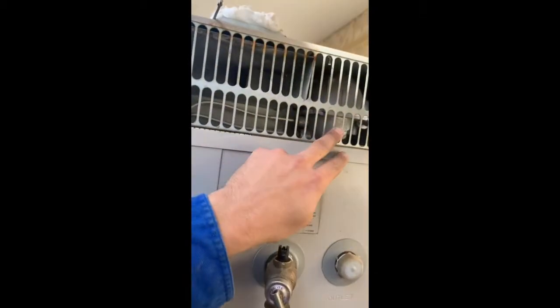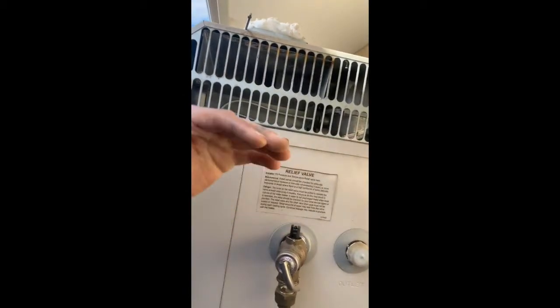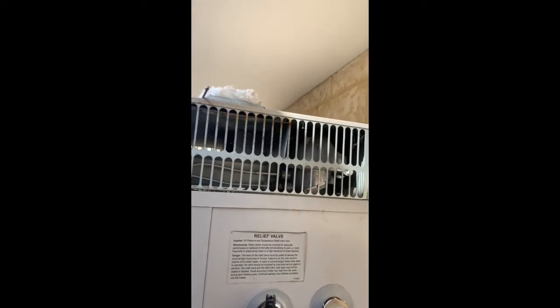What causes that is either a blockage in your flue, or in this case, this device was failing and not opening the flap in there for the flue.